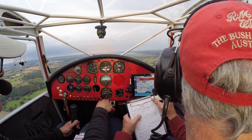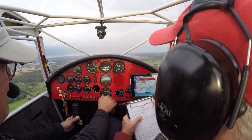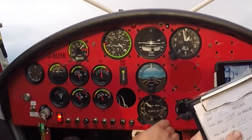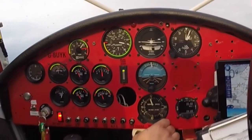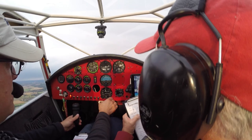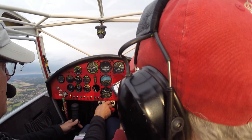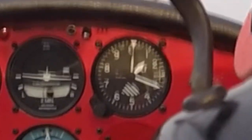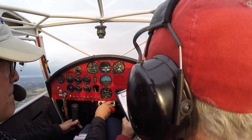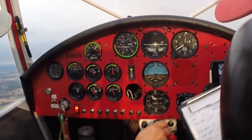As far as the time climb from 1,000 to 2,000 feet is concerned, we always start from below the 1,000 foot mark to make sure that we're established with the proper settings before we hit that 1,000. And I got the stopwatch ready in order to do that for Matt. Bearing in mind we are very close to all up weight, it did actually climb extremely well. It's a matter of recording RPM and airspeed in the climb, which is what I was doing here.